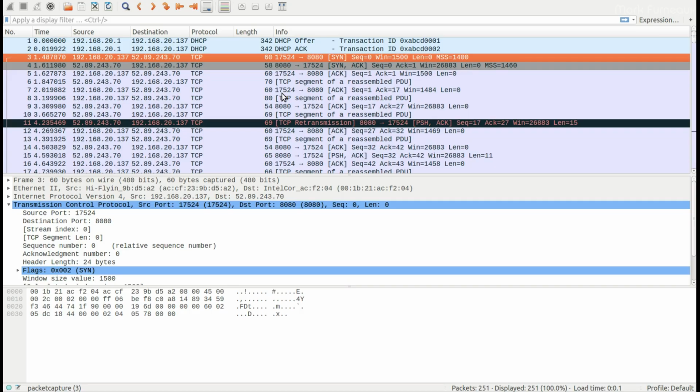So the IP address this thing eventually talks to is hard coded into the device. So they can't change that in the future. So if that IP ever moves, the devices basically stop working. So that's nice to see. I mean, it makes sense because the wireless device that they have doesn't have DNS support. So they would have had to implement that themselves, which of course is far too much work for something like this. So they just decided to hard code it. It's not great design, but I understand.